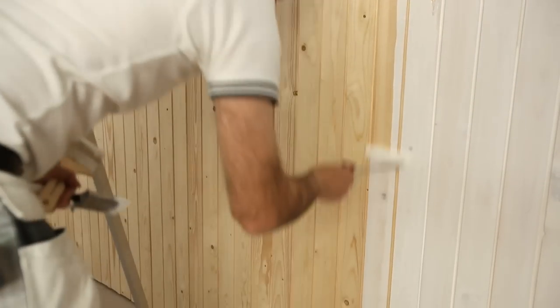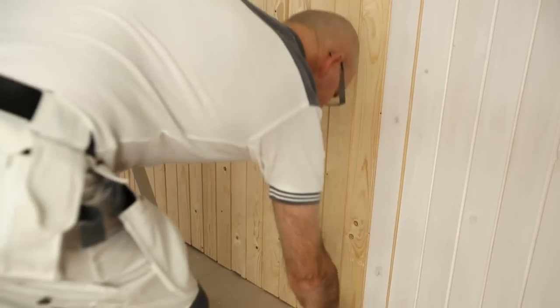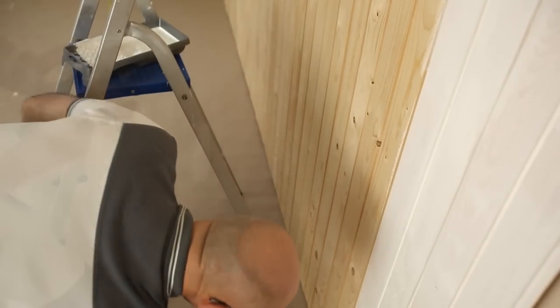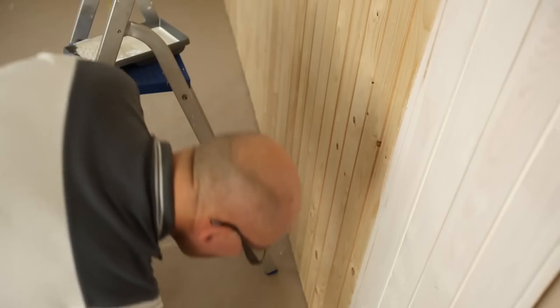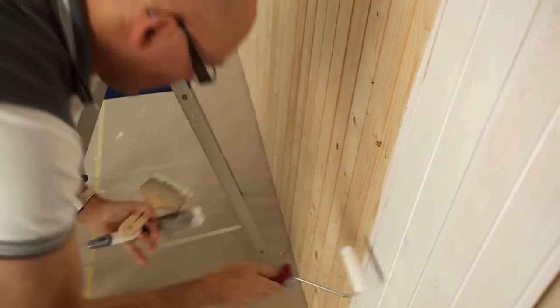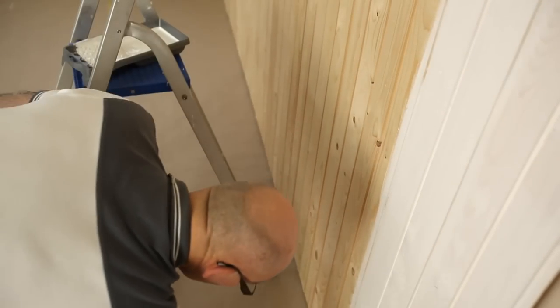Apply the paint with the roller, taking two slats at a time. Paint the intermediate gaps with the concealer brush. Spread the paint with the roller, then finish by stroking with the Mottler.